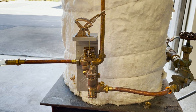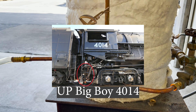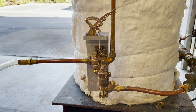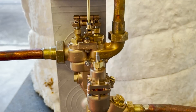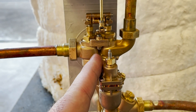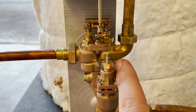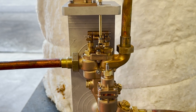The Nathan 4000 is designed after a non-lifting injector. It is designed to be mounted below the cap and should only be mounted below the cap, but the nozzles are the same as the other EE injectors — the automatic injector design — so they do create very strong suction and will be very forgiving; you don't have to let them gravity feed. The priming position really sucks in the water. On the body itself, the water valve is here, and there's a very thin wall of metal between the steam and water chambers, so the water valve tends to not really get heated. It will get warm, but it won't get nearly to the temperature of the steam side, so as long as your tender water is not too warm you shouldn't have too many problems with the injector heating up the water suction line.